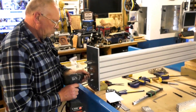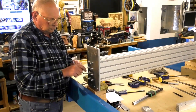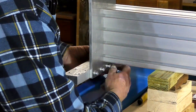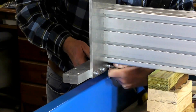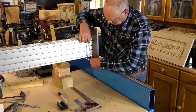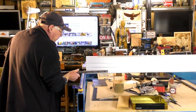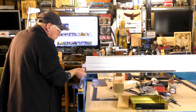How it's made and how you can make every part with just ordinary shop tools. In this case with this CNC router, I did actually buy a gantry extrusion because I priced up constructing it myself, and it was actually cheaper to buy the extruded piece of aluminium, which all turned out fine. I've designed it in a very robust and simple way. The bottom section is all tubular steel, all welded up precisely square.